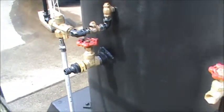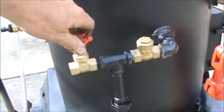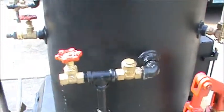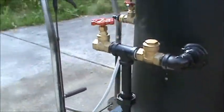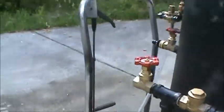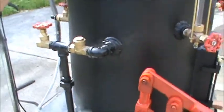Down below the injector is a drain and fill — kind of tight, but I had to put it that low. And in this one, there's a bleed-off valve for the pump in case there's an airlock. So when you see water coming out of that valve, you know the pump is primed and won't have an airlock.